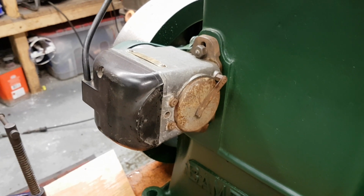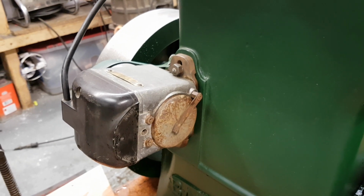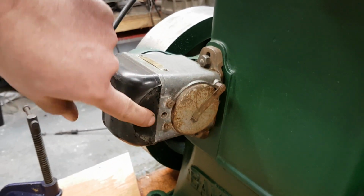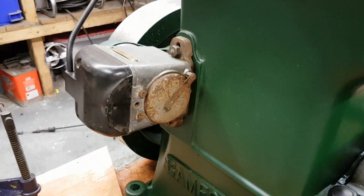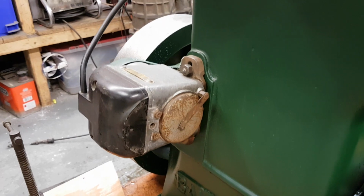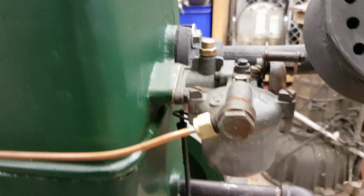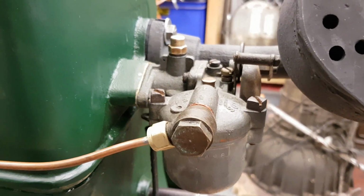And that's going to differ when it's under compression. You need a higher voltage under compression, but it seems to work okay. It's a pity this one's missing the stop and run switch, which I haven't attempted to put back. But fortunately, if I close the throttle by hand on the carburettor, it does actually stop running.